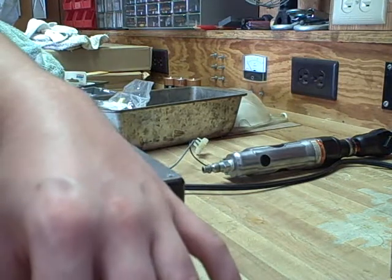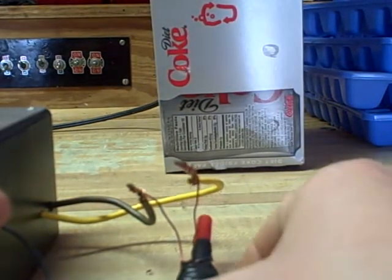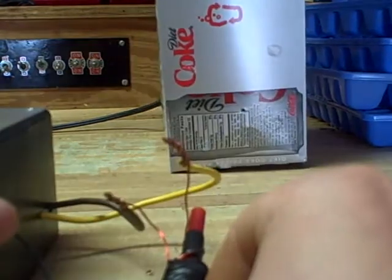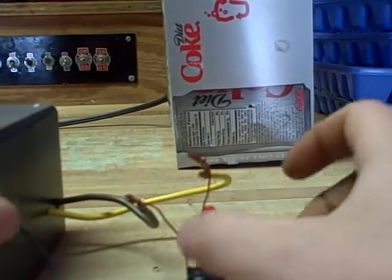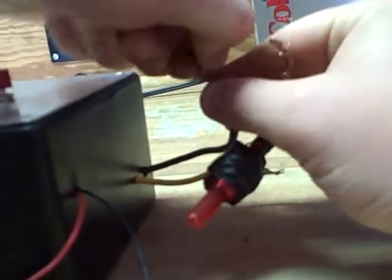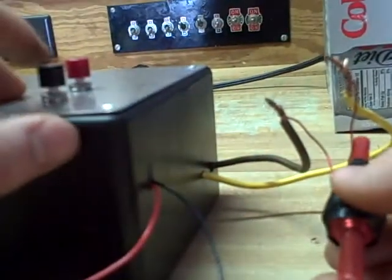I have no permanent connections right now — it's just wires twisted together. Let me charge it up first. I'm going to be shooting at that cardboard box right there. I hold the barrel so that it doesn't shoot back. See what happens when you don't have a good connection? Just sparks. You get a terrible loss of power when that happens. Not only that, but the coil keeps moving back, so I'm just going to hold it by the coil — it's got a few layers of electrical tape, so don't worry.